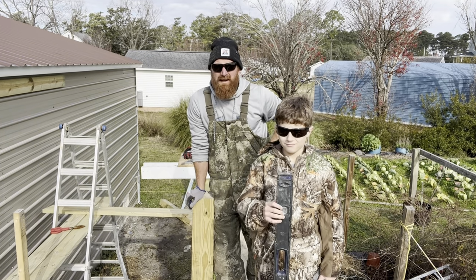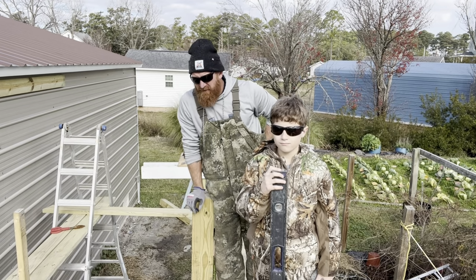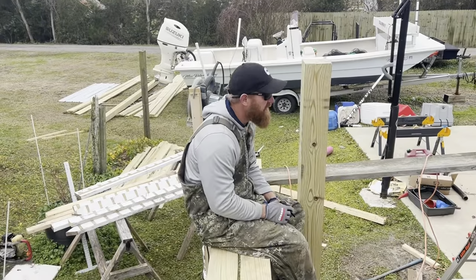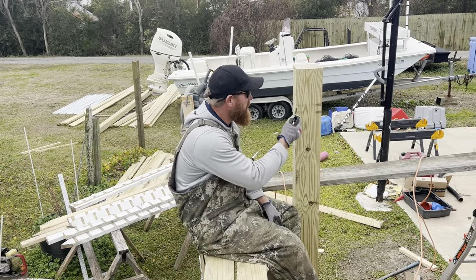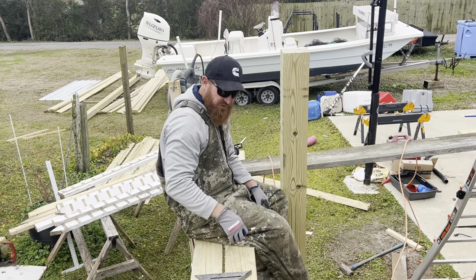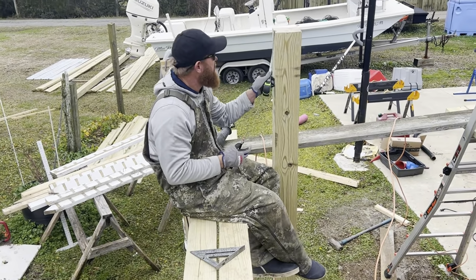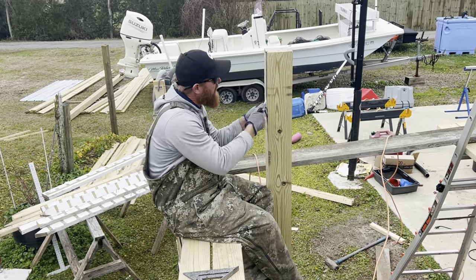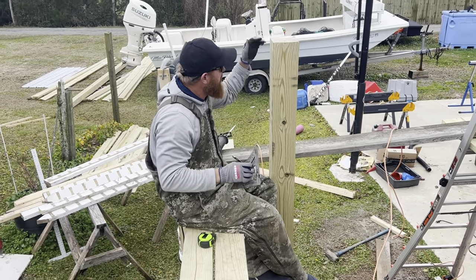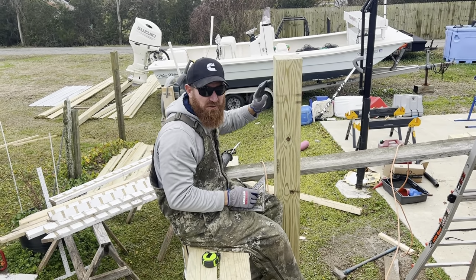Next thing is, gotta do a little notching for our front band. Let me go grab my measuring tape, need a speed square and a pencil. See you soon. Folks, our next step is we're gonna notch every one of these poles in the front. We're using a 2x6. The width of this 2x6 is 5 5/8. Go down 5 5/8, make a mark. We're gonna go 1.5 inches deep. We're gonna cut, notch each one of these out. Our band will sit right in there flush.